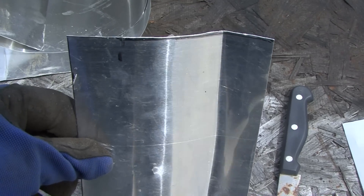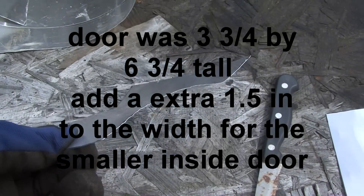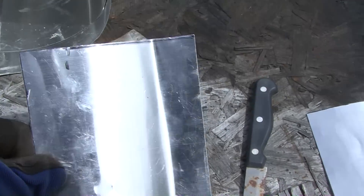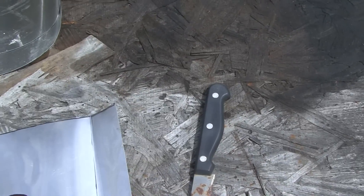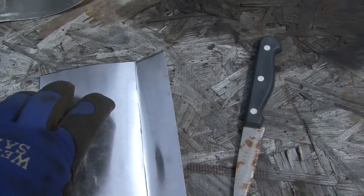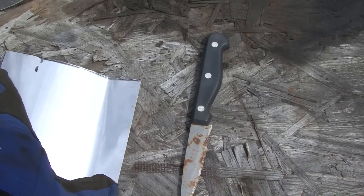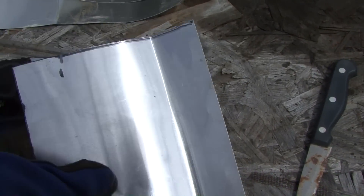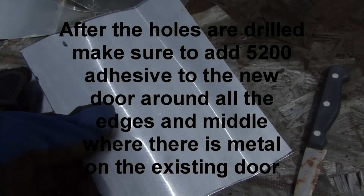The door on the plenum was bad on this one, so what I did was go ahead and add an inch and a half on the edge and put a slight curve on it. I already made the other piece so I just used that and bent it up in here — it slides right back in. The other side of the plenum door on the back also had foam and it was already gone too. Next we're going to drill some holes, add the 5200, and screw it all together.